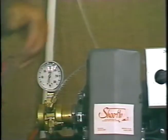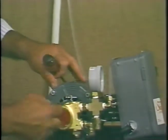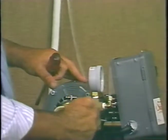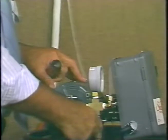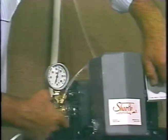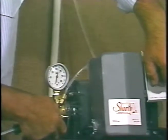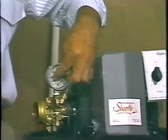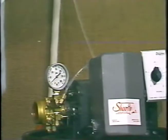What this allows to happen: instead of using the bypass within the pump, you have extended over and you're using the bypass flow for the excess amount of fluid for the pump to go back through the check valve. The reason for doing this is when the system is turned off, the bypass pressure is around 20 pounds of pressure. And when you close it, the needle will fall immediately 20 pounds and will allow your nozzles to turn off immediately.